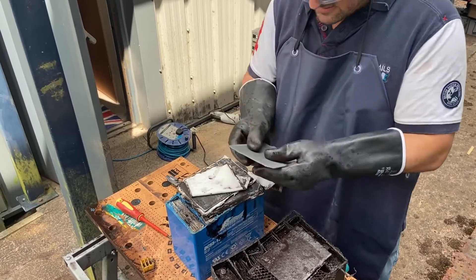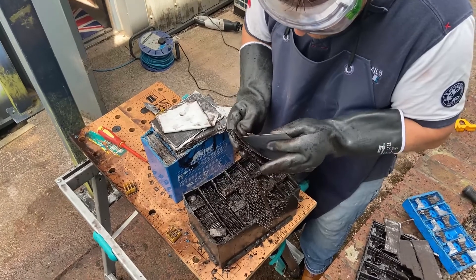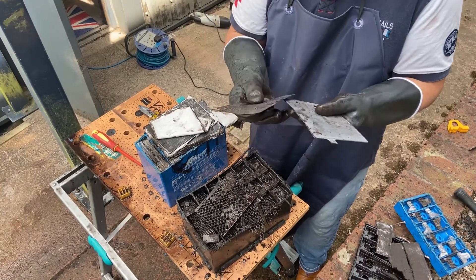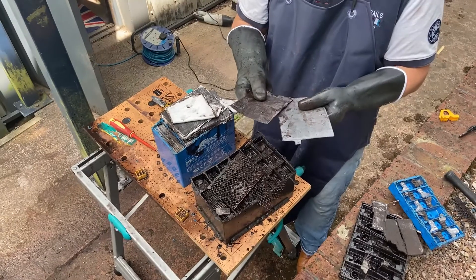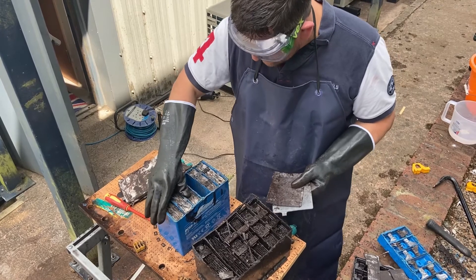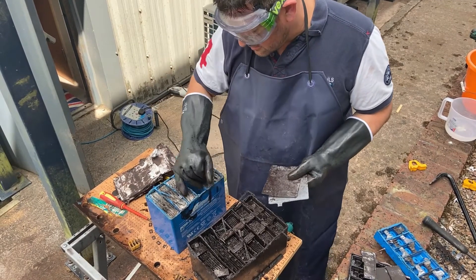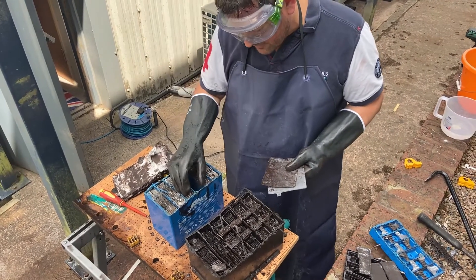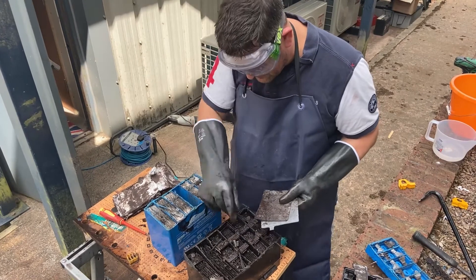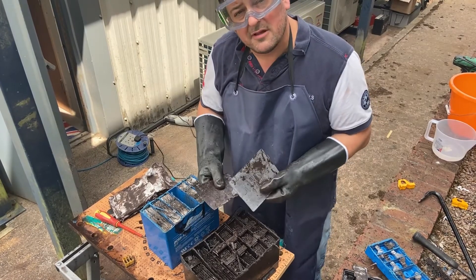You can see it's not flexible in the same way as the standard battery grid. There really is your difference — you can see the amount of lead in the Full River plate versus the standard plate, and that's where your cost difference and your performance difference comes from. Within the Full River battery, the cells are highly compressed and it's really quite difficult to get them out, held in place within a very thick battery case to stop them moving about. On the standard battery they're much more flexible and will move about — quite a significant difference when it comes to preventing the shedding of active material.